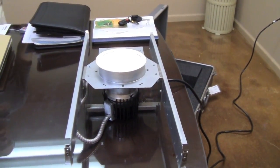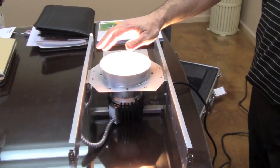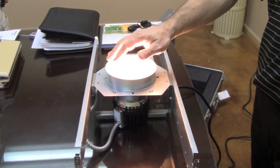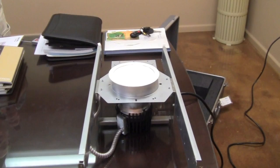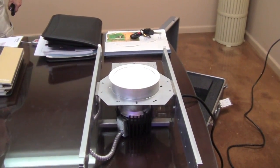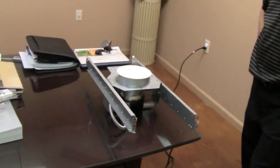So I guess you have a problem with LED and landscape lighting with shadow effects. Is that a concern in landscape? You could, if it's multiple LEDs, you bet. On some things it wouldn't matter if you have a lot of leafy things, but on a tree, now you've got multiple shadows. Well, but again, it depends on the mounting distance, the spacing between them. Like what we did in landscape here, lighting's right up on it though. Okay. Yeah, but you're kind of shining up. Right. Grazing.